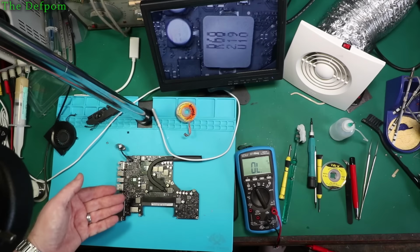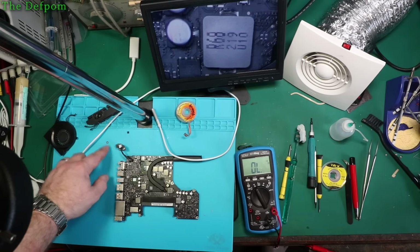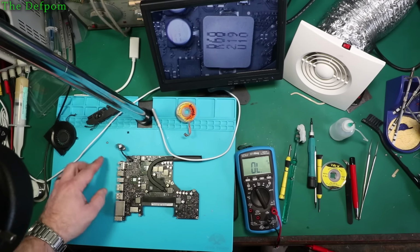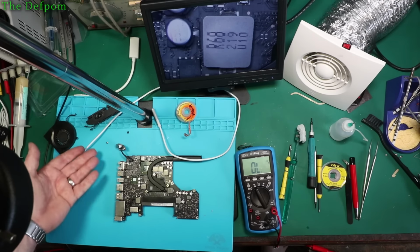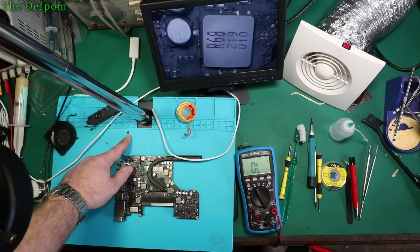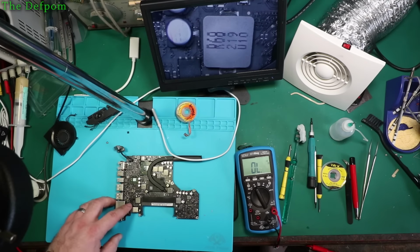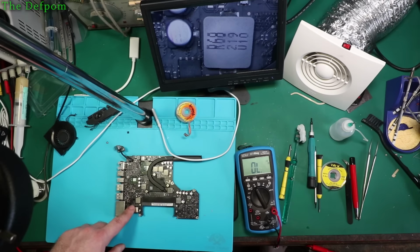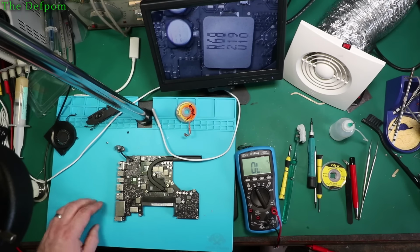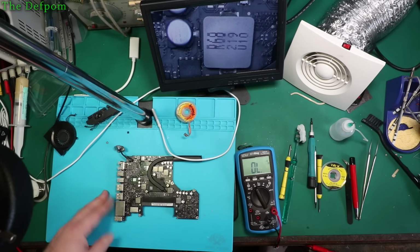Obviously the first thing I'll do is get this supply working. So I took the MOSFET off. I'm suspecting it's shorted, I'm not completely sure, but I'm getting the same reactions without that in place. And I've changed the ISL6259 again with the original one, put the original one back on again. Didn't change anything, because what's happening is the MOSFET gate pin is sitting about 0.05 less than the rail itself, which I'm thinking is a bit strange. It must be like there's a short somewhere. There could be. The main thing I want to do is take that chip off and make sure it's okay, but anyway.